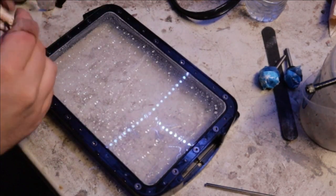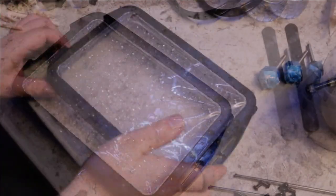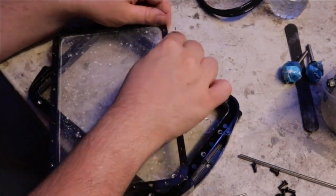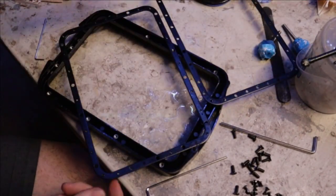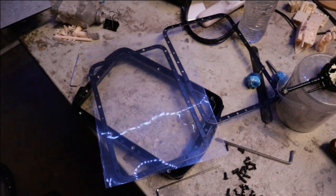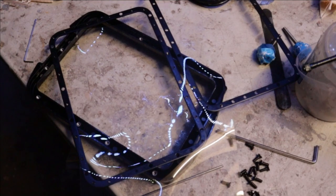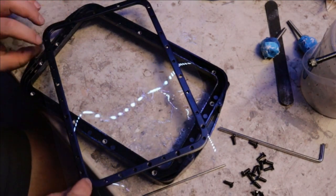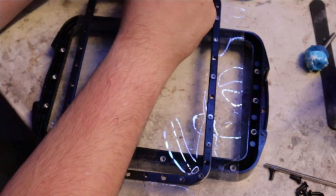Clean the tank with alcohol and flip upside down. Using provided Allen keys, remove all the hex bolts around the frame. Remove the frame out of the tank and flip to the other side — just like the previous side, remove all the hex bolts around the frame; these ones will be shorter. Keep note of the countersink holes and sides of the frame for reassembly. Open and remove the old film. For larger printers, FEP films are less locally available and quick-ship is very expensive — ideal to pre-order and stock a few. They'll be sandwiched between two protective layers that will need to be removed. Sandwich the new sheet, taking note of where the countersink holes are. The rest of the steps will be in reverse of the disassembly.